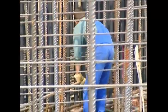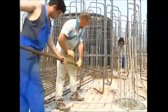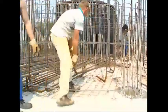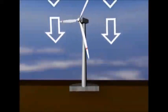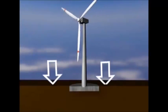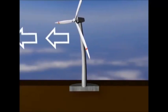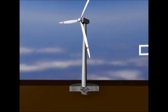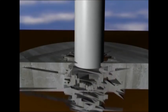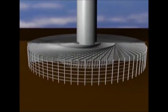One of the first steps is to prepare the foundations. Here they're using reinforced concrete — this is the steel framework that the concrete will be poured into. The concrete can bear the weight of the tower on its own, but it has to be reinforced because like any tall structure, it's going to face some stiff winds. Without the steel reinforcement, the concrete would deteriorate and eventually give way. The steel frame gives the concrete enough flexibility to take the battering.